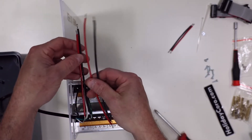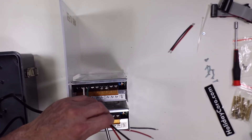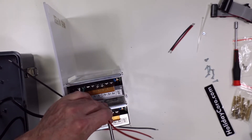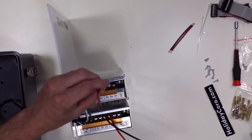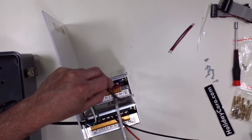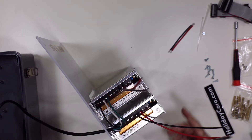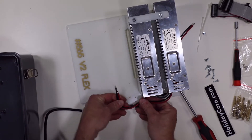We have these pre-cut. What you can do is just cut an extra length of cable, mount everything, and then once it's in place cut the lengths to fit. I'm putting in positive for V+ and negative for the minus. We're going to hook this up to the second one — again, this is because we're running two power supplies. This might be for running, for example, 100 pixels on a single 16-output, making a mega tree that's 16 strings by 100 pixels at 12 volts.